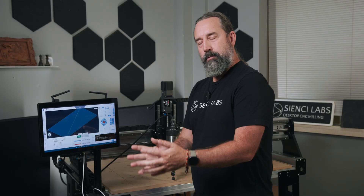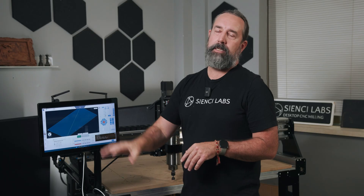That's the top tip for today on how to surface your machine. Always remember: turn off the hard and soft limits — that's the first thing you should do to make sure you don't have any alarms. Always home your machine first. Then you're going to zero the machine where you want it to start, move it over to the extents and record that number, input the number into the surfacing tool, go back to zero, set your Z, and then you can run your job. It's as easy as that.